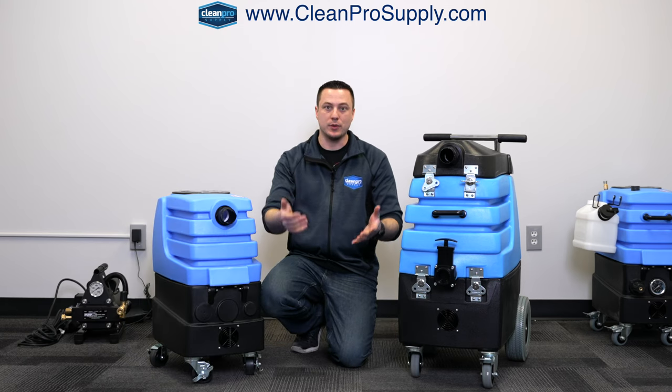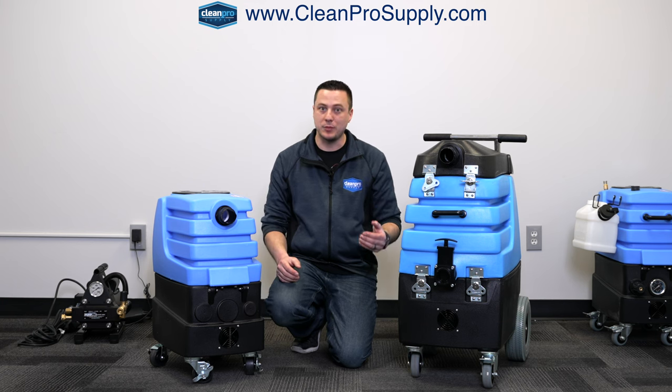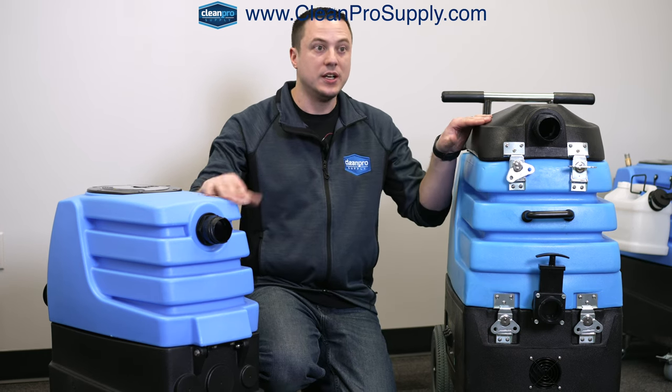As far as how far you can go with your vacuum hose, I would say you can go up to 100 to 150 feet of two-inch vacuum hose. You could stretch it to 200 if you like, but your performance is going to start to diminish. If you keep it in the range of 100 to 150 feet of hose from either machine, you're in great shape.